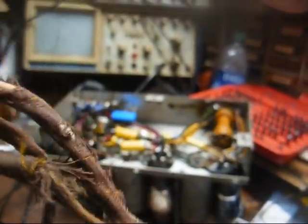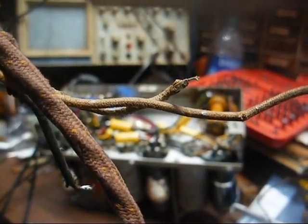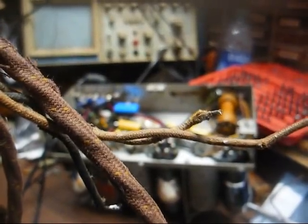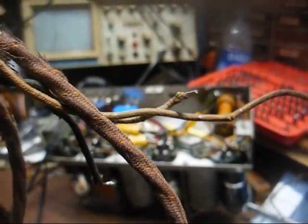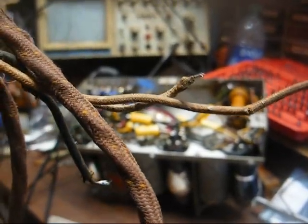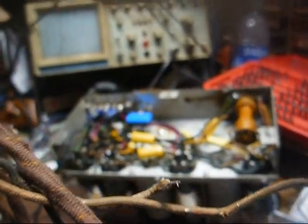All right, I've removed our resistance line cord and installed a regular 2-wire power cord. And for the resistor, my Ohm's Law calculations came out to 150 ohms and 13 watts, which, of course, we'd want to go up to a 20-watt resistor just to be on the safe side. The schematic calls for 160 ohms, which can be explained by possibly me using a different line voltage figure than what they used back in 1933 to calculate this.